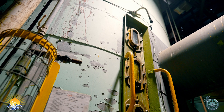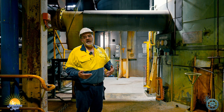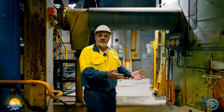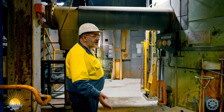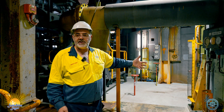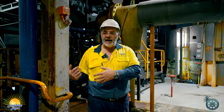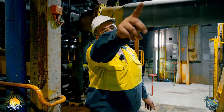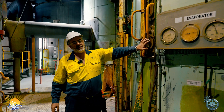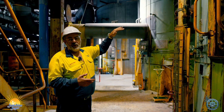So the clear juice which we've just made in the clarifier contains a lot of water — too much water in fact that we can't make sugar cost effectively by trying to boil all the extra water off in the vacuum pans. So what we have here is our evaporator set. The clear juice comes across from the clarifier and we start the evaporation process. Essentially we're concentrating the juice before we send it to the pan floor to make sugar. As you can see in these vessels we can see the boiling juice.